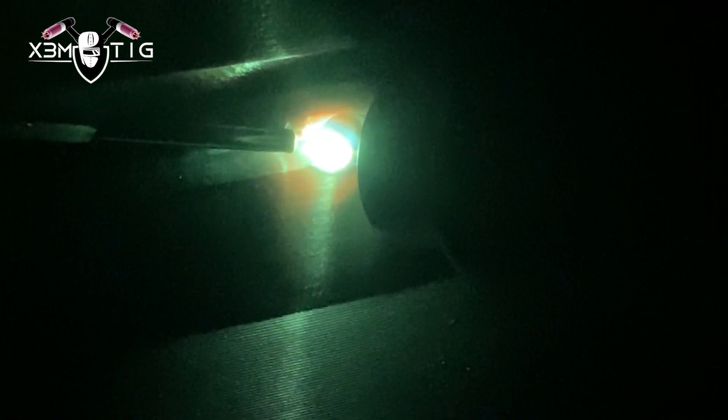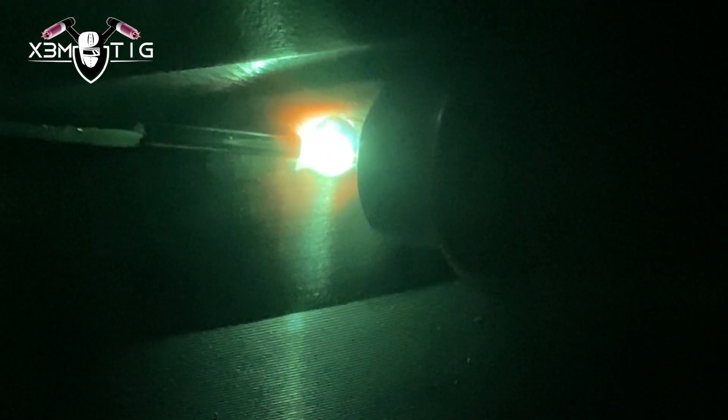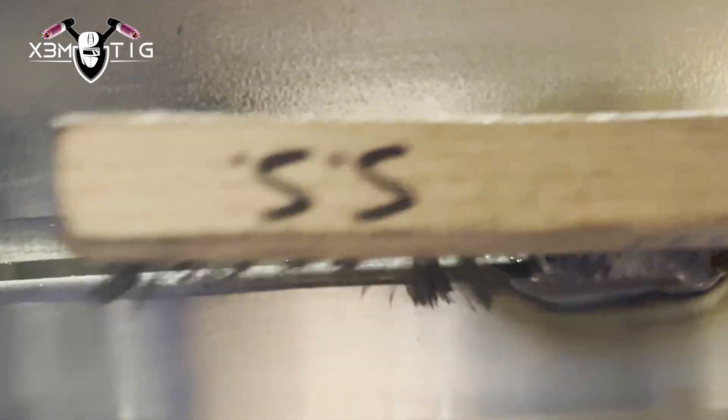In a shop or on a table, there's no excuses for better fit-up. For the bridge tack, it's a 5/32 stick stainless stick — just knock the flux off. Four pieces. Make sure when you weld, the weld stays inside the bevel; don't go outside of the pipe. It looks bad and it's not professional.